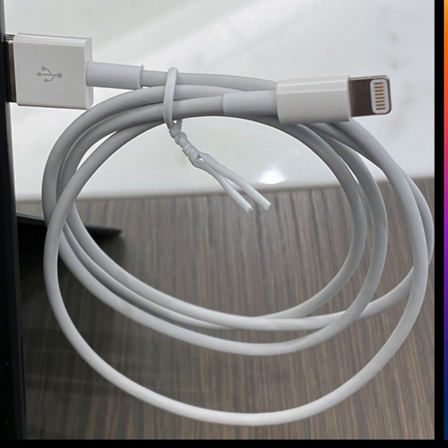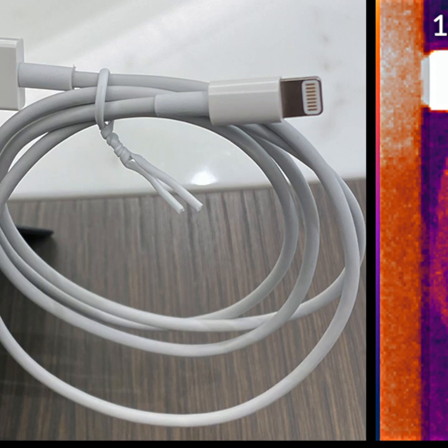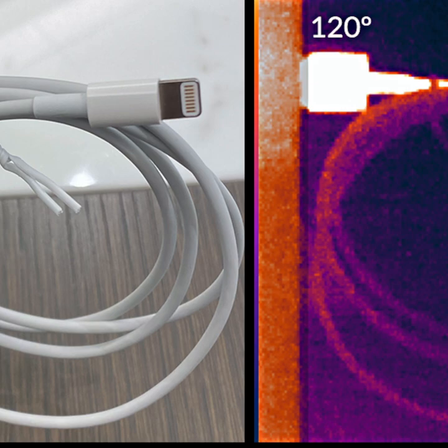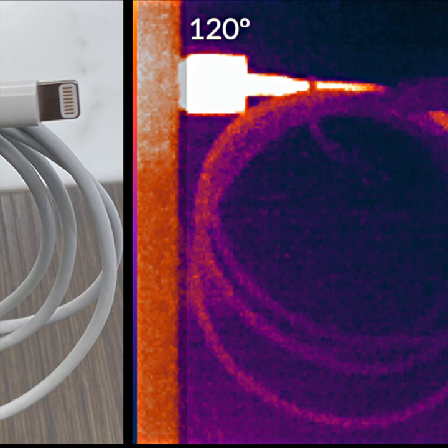Traditional USB spy cables look like normal cables, but as in the H.G. Wells story, War of the Worlds, this invader has an Achilles heel. Electronic circuits generate heat. Our spy Martian is no different. When plugged in and operating, the USB-A side of the cable measures between 115 degrees and 125 degrees Fahrenheit, or 46 to 52 degrees Celsius. If your fingers are sensitive enough, you may be able to feel the warmth.